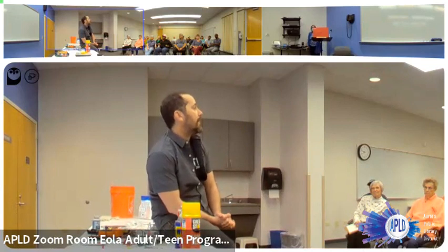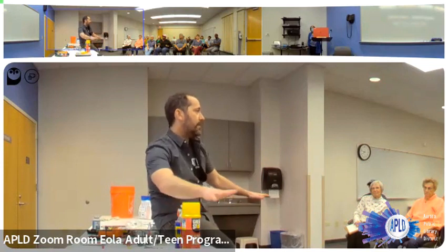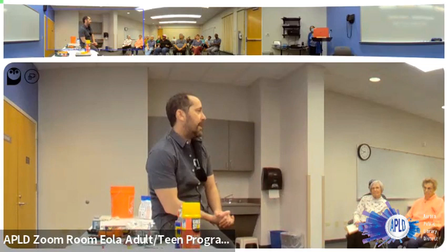Can you see a crack or anything anywhere? No. Some of it's got stuff in it, but on the one wall back there, I cut away the drywall and I don't see anything, so it has to be underneath where I'm not able to see. And the moisture's always showing up during the rain, right? Yep, and then it starts coming in. If it's not massive yet, like if it's not really doing damage yet, probably the cheapest option might be to talk to a landscaper. Again, if you can increase drainage away from the house, that's going to be the cheapest person to get out there and do that well.